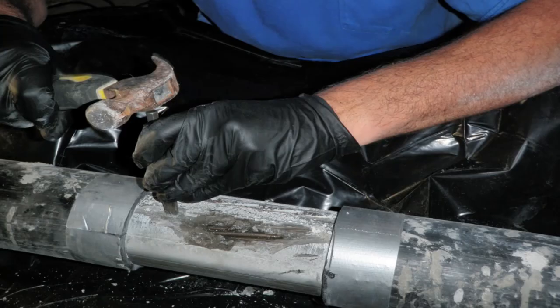Those photos were from actually the first project that Florida DOT did using this technique, and that was 5 years ago, I guess. And at that project, they made 24 openings like this just to verify that the material had passed through and it was actually soaking, it was present. So here is a picture of the duct. They've cut a section out of the duct here, and you can see the grout. And this is one of the engineers that they had there.